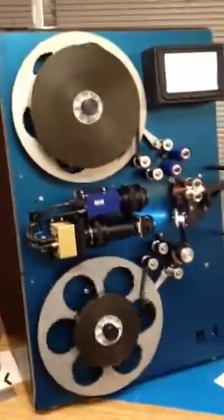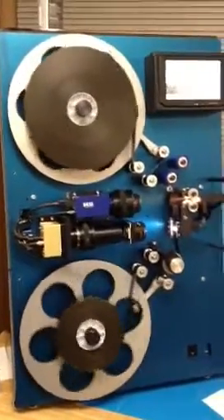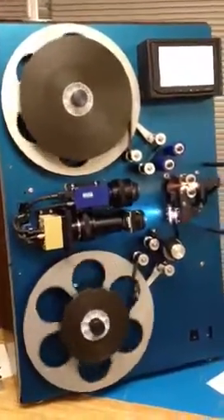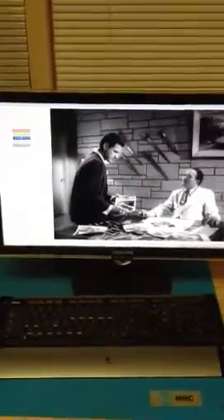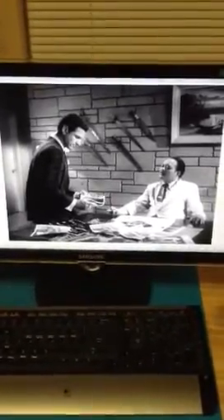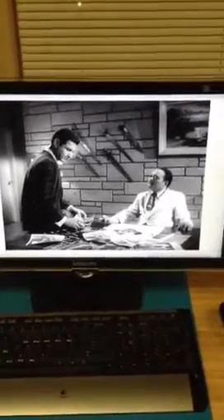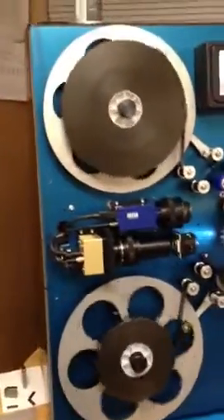It's going at about 10 and a half frames per second, 2K, and it's dumping raw data to disk. Then this program, Bestmovie, picks it up and applies the color settings you want, dumping it out as whatever file format you want — in this case DPX 10-bit linear. This is a good sequence here on the film.